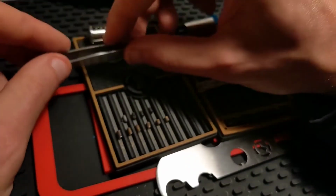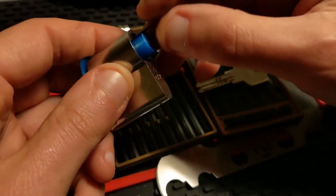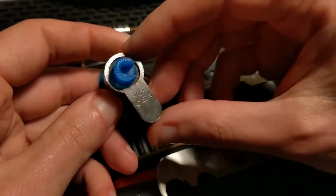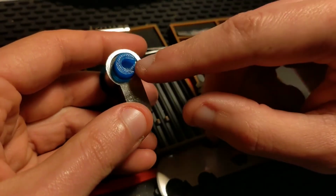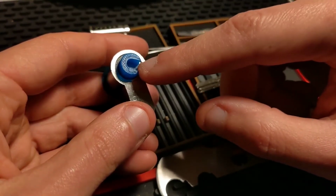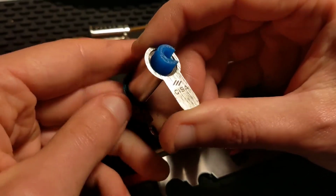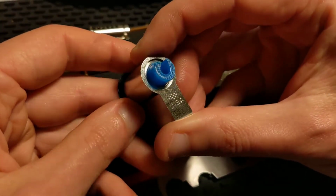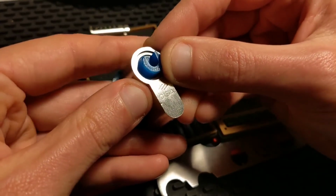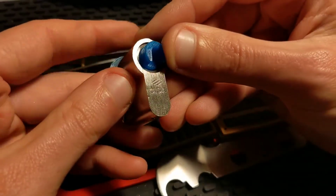Okay, so now let's have a look at what's in the lock. I can remove this shim. You see what I did here is I included a notch in this follower, and hopefully that lets me get the pins one by one. I will start with the bottom, because the first one at the bottom is going to be first.